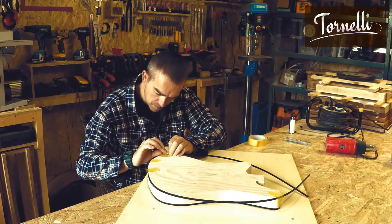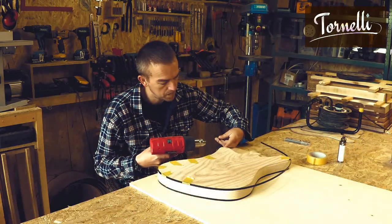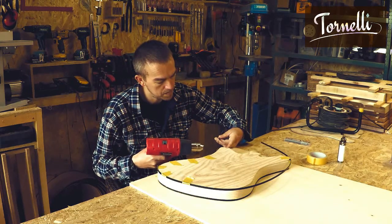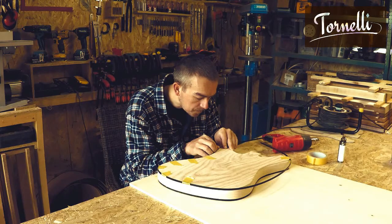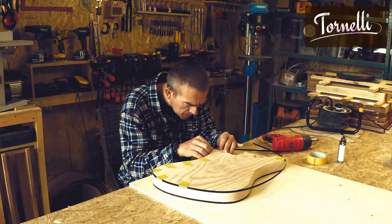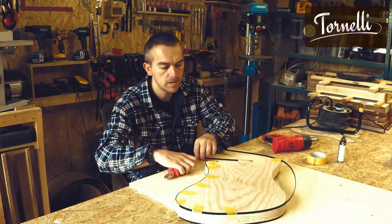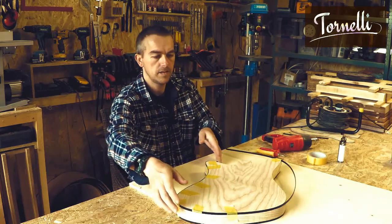When it comes to heating up the binding to go around corners, I hold my finger behind the binding where I'm going to heat it with the gun as a way to judge when it's heated enough. When the heat gets a bit too intense for my finger, that's usually the point the binding is warm enough to bend around a pretty tight curve. With darker plastic binding, if it's too cold you'll get stress lines appearing as white vertical lines, and if it's too hot the binding will warp. So if I'm dealing with any curves at all I'll always heat the binding.